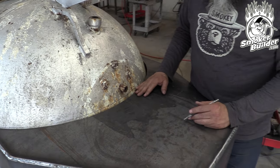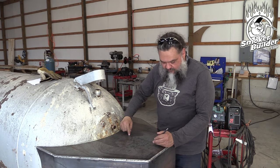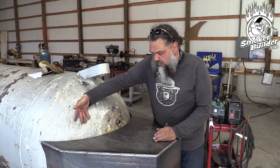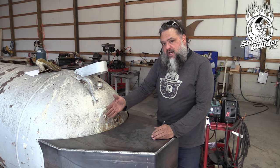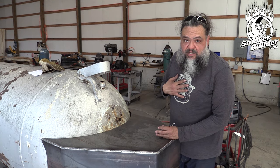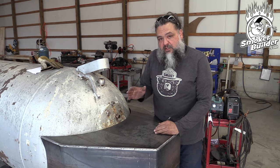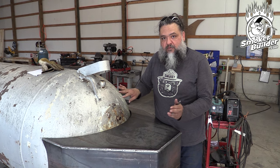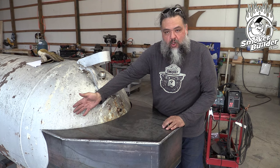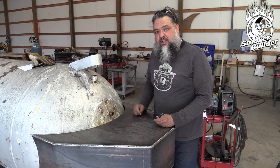Now what's a little tricky is we're on a curve — there are fast curves and slow curves. A slow curve is going to be a nice arch; a fast curve is going to be like a return. This has a little of both worlds: a very quick curve on the edges that flattens out over the front of the belt and picks up again on the turn. So if you take a little material, it's going to go pretty far and affect the gap. Slowly increment — we're going to take away material to inch this thing forward just a little bit to close all these gaps.